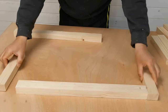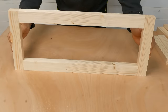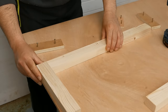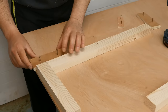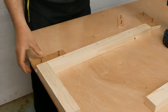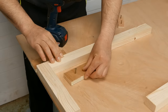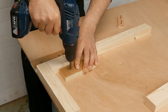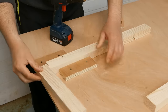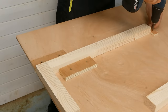First I will make the short sides of the frame, and they will look like this. I put a 55 cm long piece on this plywood board, and I need some room to put a 25 cm long piece in front of it. This stop block will help to align both pieces, and another stop block will help so the 55 cm long pieces don't move to the sides. Like this it will be easy to put all the pieces always in the same position. I put this stop block so the pieces don't move back when I screw them.